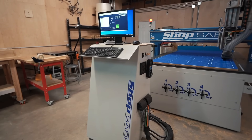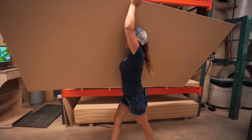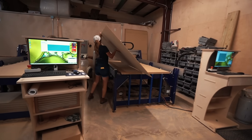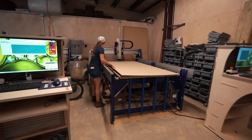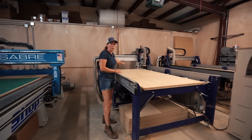When loading up the CNC machine, the vast majority of what I'm using these machines for is quarter-inch MDF. It's a little bit thinner of material, meaning that if I'm not using a vacuum bed — which these two machines don't have — it needs a lot of hold-downs to hold the sheet nice and flat, so that you'll get a nice, consistent cut throughout the entire sheet.